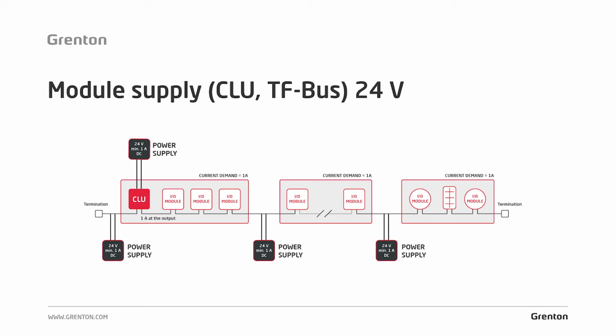For the bus, you can use one larger power supply. It does not have to be one power supply for each bus module. Such a solution would certainly be the most optimal, because then the bus will be powered from several different power supplies, which increases stability. While in such a system, you can use a more powerful power supply, for example 6 amp, and connect it directly to the bus module.